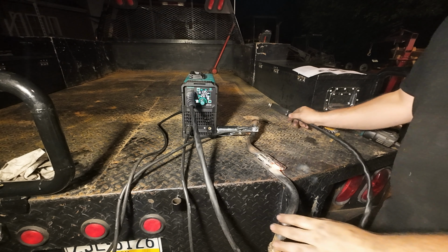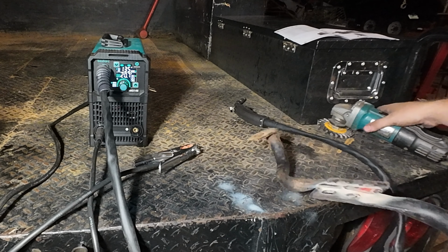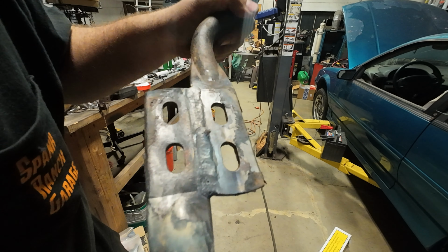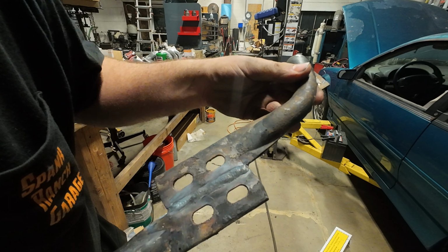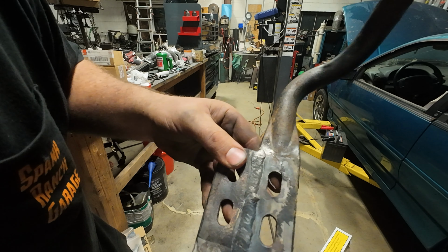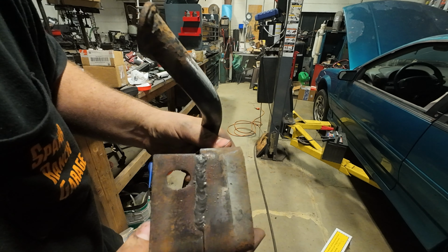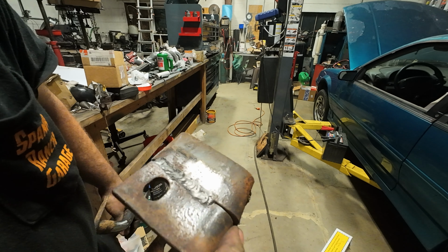Nice and hot. All right, you've got a quarter inch glow in here. Here's a better look in the light at some of these higher metal thickness welds. So it's full penetration on almost a quarter inch. Hit it from both sides. It lays a nice flat weld. You know, smooth, not the prettiest, but flux core is hard to make pretty. Here it is on some actual quarter inch, but way lower amperage. This is one of the first welds I tested it out with. It would hold things together, there's no doubt about that.